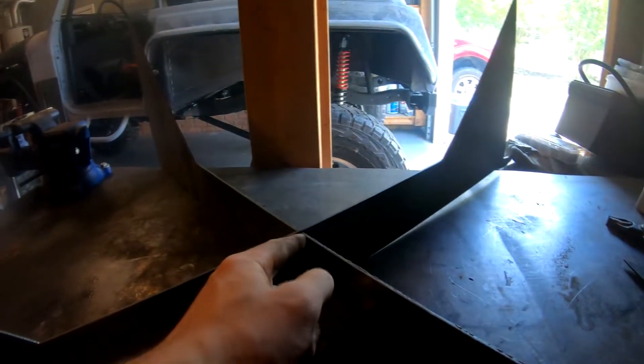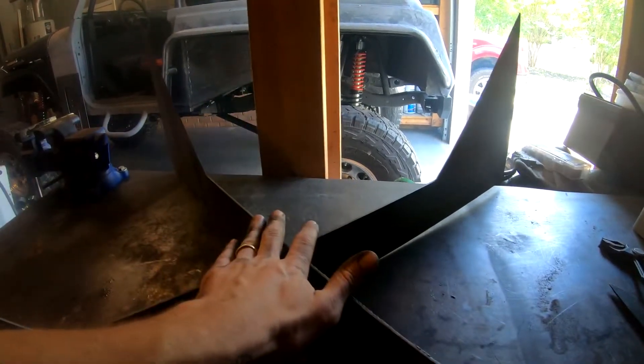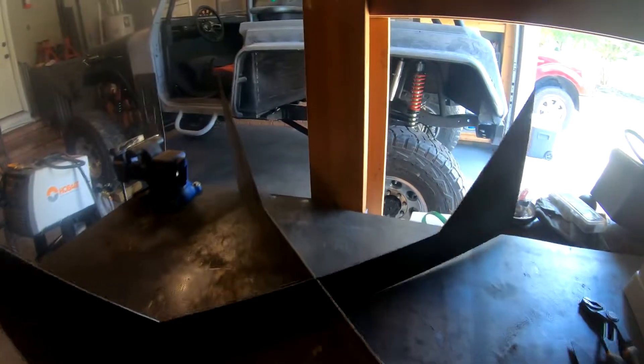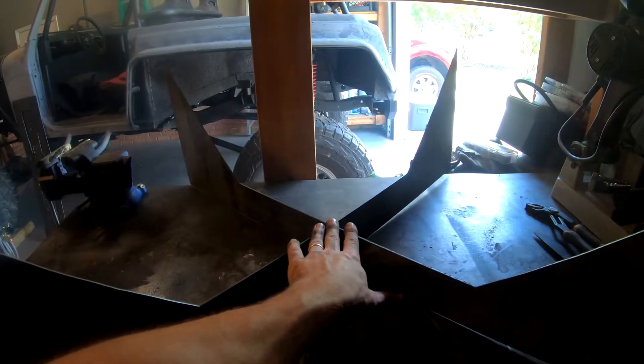You can see how the base goes together. The base is notched on the plasma cutter before it comes out, so these two pieces slide right together, and then that flat base plate sits down on top of it, and that's what provides all the structure to the subframe here. Pretty simple little design. It's about a three foot distance from here to here from each of these points, and then it comes down to an 18 inch base lower section.